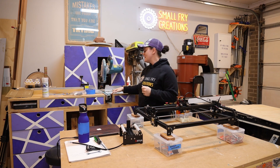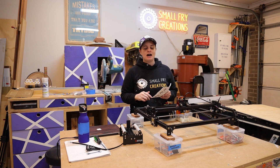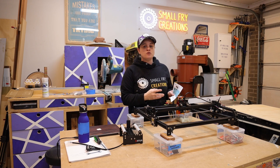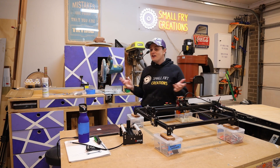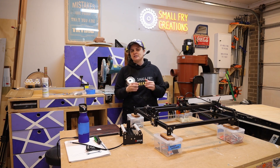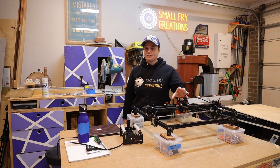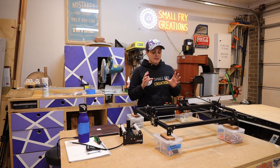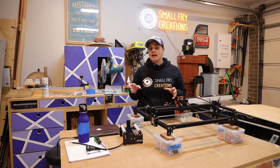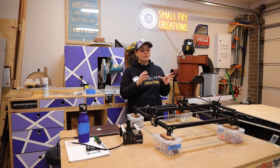The rotary is all put together — it's not too hard to do. The manual does include pictures with written instructions and I'll also include a video below if seeing it put together visually is more your jam. But I think there are two critical things missing from these instructions. Number one, they do not show you how to set up the rotary using LightBurn — they run you through with Laser GRBL but there is no mention of LightBurn. And even more critical than that, they don't include how to actually use the rotary or how to make adjustments. For the last two nights I had to put the camera down and troubleshoot, because when I connected it to the laser I ran into a whole host of problems — it couldn't frame and was running into different axes. It turns out I was running old firmware out of the box: firmware 185, when the latest is 187. I've updated the firmware — you can do that on Mac or Windows PC and it's pretty easy to do. I think I'm now at a point where we can actually use the rotary.